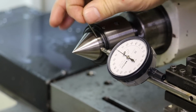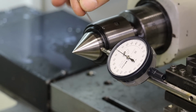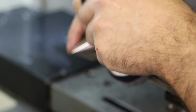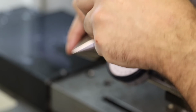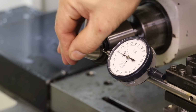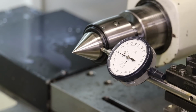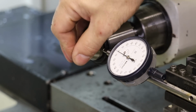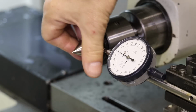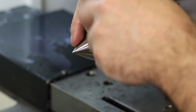On this packing ring, there's a couple of spanner locations, a couple of holes. I don't have a spanner wrench, but this is a cutoff ejector pin, 1/16 hard steel, and you can tap the packing ring down, or basically I'm rotating or seating the bearing a little better. And we're looking at our accuracy, and there it's basically moving about 1/10. Now this is all kind of subjective because I'm also flexing the tailstock a little bit, and I don't have a specific force I'm applying, but I'm also spinning the live center to make sure I'm not binding up on the bearings. But basically we want to get as tight on the bearings as possible to wring out any kind of slop in our final turned part